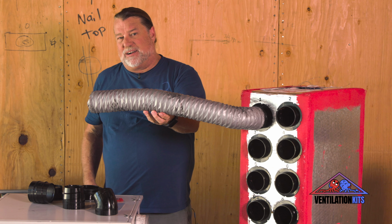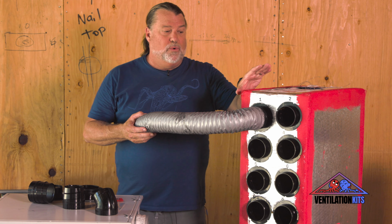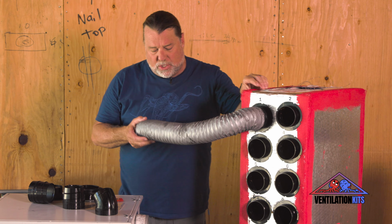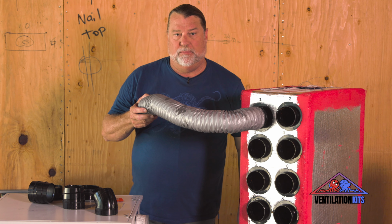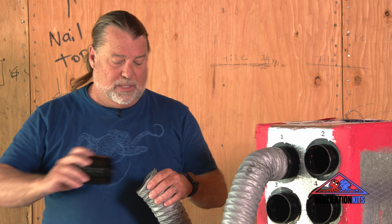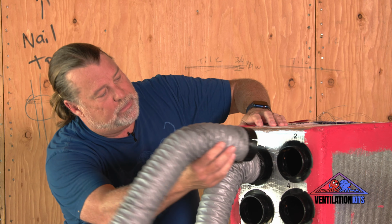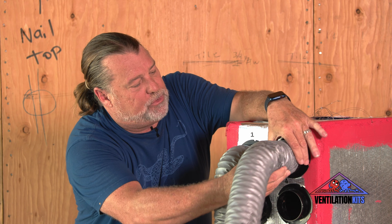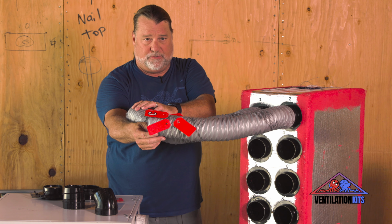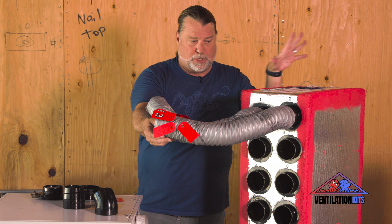So imagine this tube right here is, obviously it's the red box, right? That's the stale air. And so this tube is going to either go to bathrooms, laundry room, or kitchen. So for right now, we'll say we're going to the bathroom. The bathroom needs 2 tubes. So the 2 tubes are going to be installed into the manifold, and they are going to go all the way to the bathroom, wherever that is. It could be 35 feet from where this manifold is set. We typically like to set the manifold in the center of the home so that the distribution is equal.